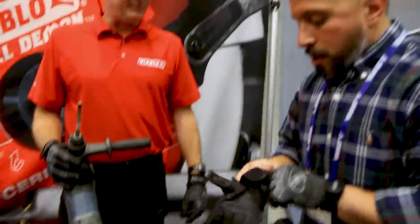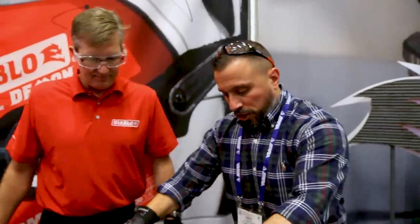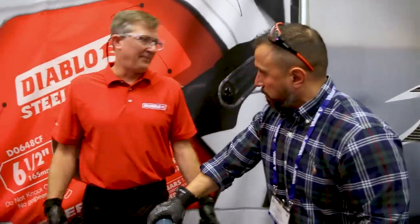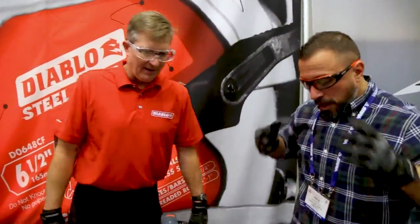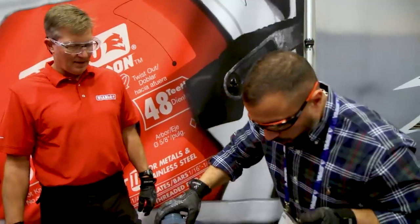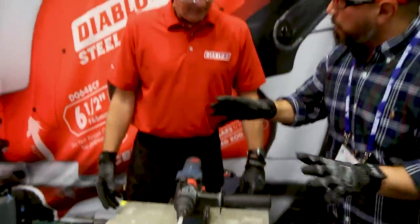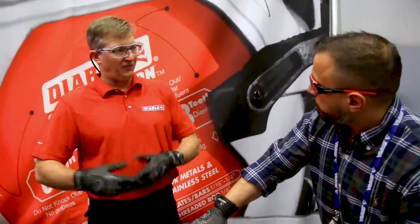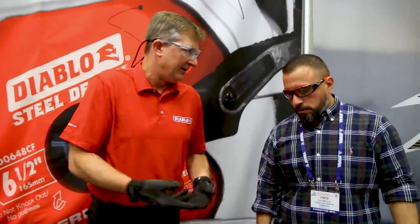It's probably around three — it's fresher concrete. How many more holes is this good for in the rebar? It depends on the size, how you hit it, the drill. I'm saying this bit will go through this bar — that's the solution. The full carbide head brings that solution for concrete or reinforced concrete. When you hit rebar, you don't have to go get a rebar cutter. One bit, one solution — that's the idea.